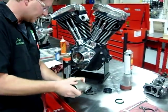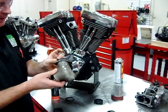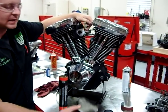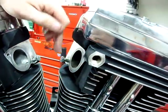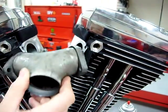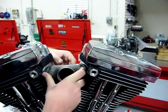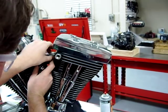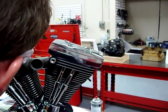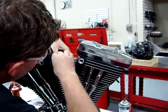I'll go ahead and do the other side here as well. I'm not going to go through the whole process of torquing this down and cleaning everything on this particular motor, but you guys will when you do yours. One thing about Harley-Davidson — a lot of these, you're going to have two bolts that are left in the cylinder head. We can definitely see the F or rear mark we were talking about for front or rear. So we're basically just going to hinge this in place. The Harley manual doesn't tell you much or anything except to get this in place. I'm going to get my bolts roughly set up. Do you guys notice how as I'm putting this together I'm just wiggling it continually? We're basically letting stuff settle — we're going to find that sweet spot, same as when we did our rocker covers.